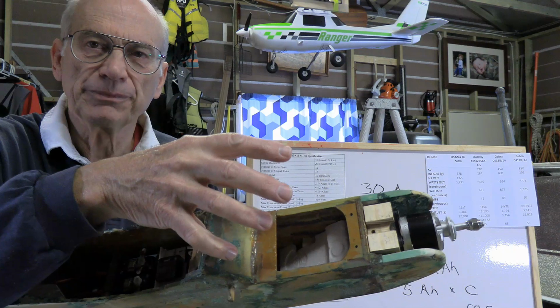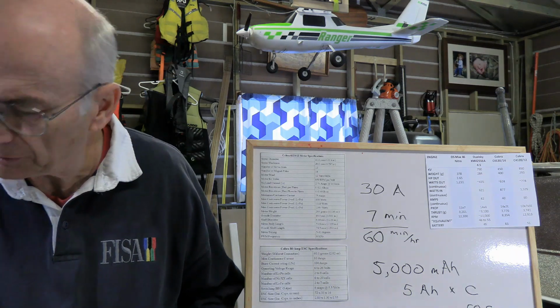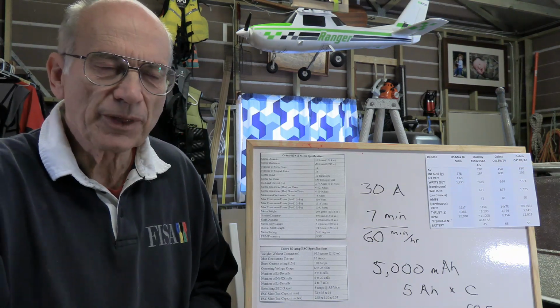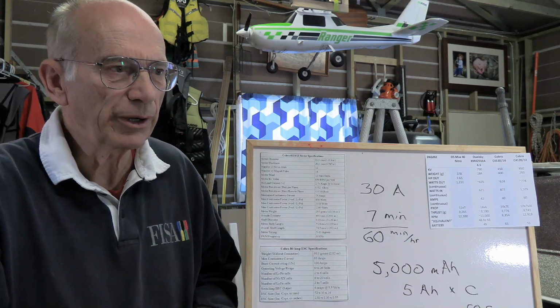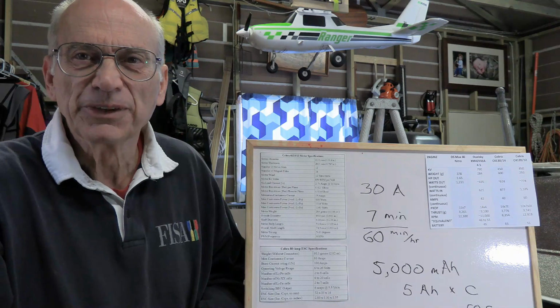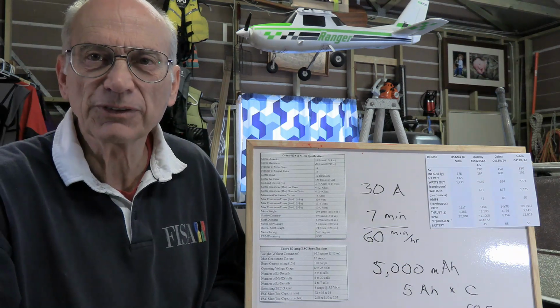But the physical size of the battery is going to be an important factor as well in what you select and how you go about doing it. For a lot of the foam planes, it's very common for me to have to modify the plane to fit the battery. And I found that not all manufacturers have the same size for the same specification of battery. Just thinking about the P51, when I got the E-Flight battery for it, or the Spektrum battery, I guess it is. Get all their brands confused. But anyway, with the Top Flight one, it's actually a little bit smaller physically and a higher C rating than, say, the ACE battery that was the equivalent with even a slightly lower C rating.